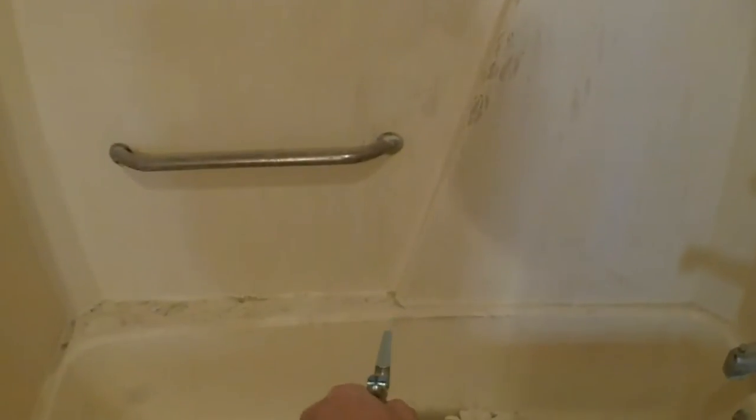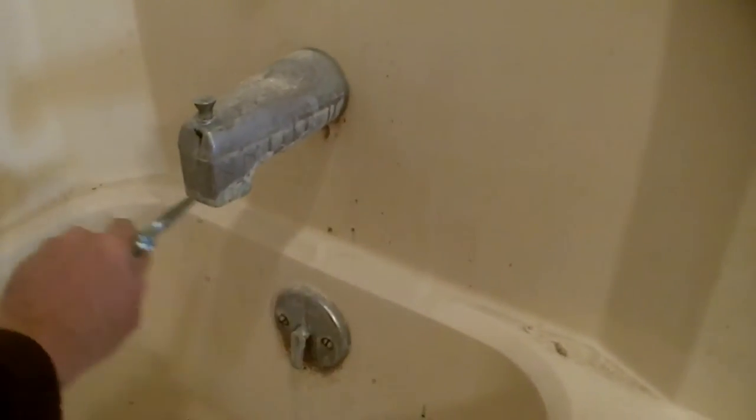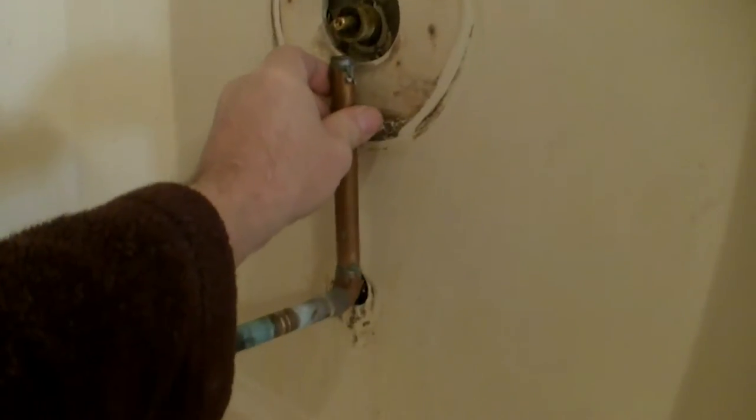If it doesn't come out in one piece, I'll do a second cut from here down. I'm not concerned about electrical or pipes in this area, but I need to be careful on my depth coming across here because there are supply lines coming up to this shower valve. Once I make that cut and get the top out, we should be able to lift the tub up, maybe get it on end and work it around the corner. Here's where the spout comes out — it sits in here and drops out the bottom of that shower valve to fill the tub.